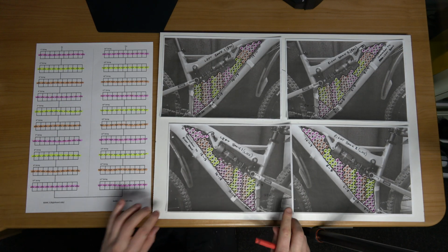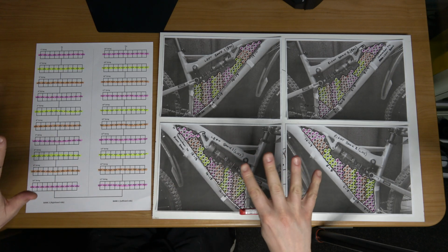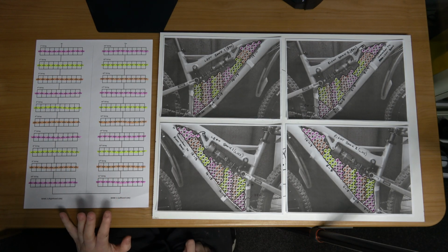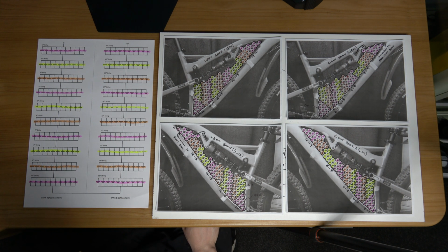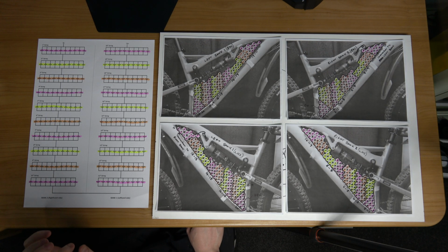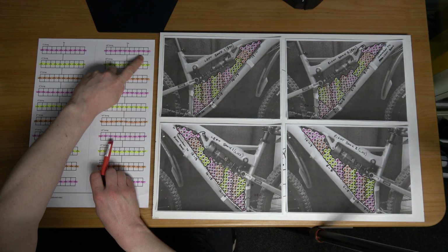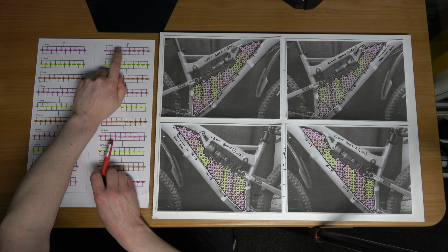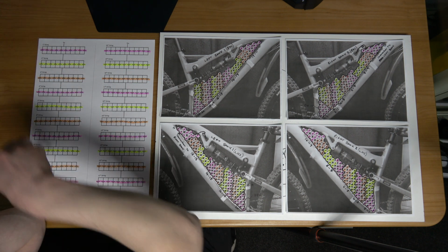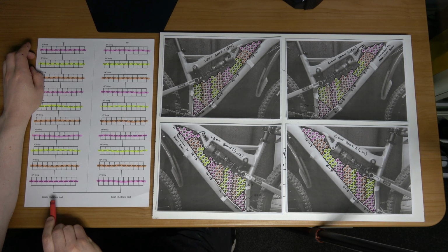Okay, so I went and redid everything out on A4 paper rather than the A3. So I'm just going to give a quick overview of everything, and I'm going to finish this video off. So on the left here we have the plan that I created to configure my battery pack. So the cells I'm using, as I mentioned at the start of this video, are high capacity cells. Each cell is 5000 milliamp hour. So if we take this into consideration with respect to this parallel branch, 10 times one of those 5000 milliamp hour cells gives us a 50 amp hour battery. So then I have 10 parallel branches, 10 cell groups on the left hand side here, and 10 on the right hand side.